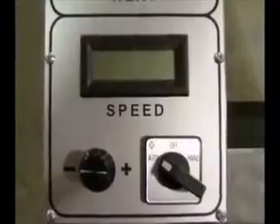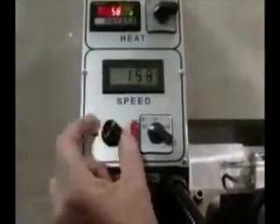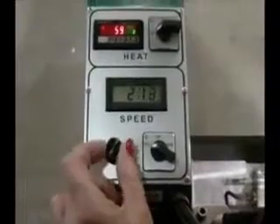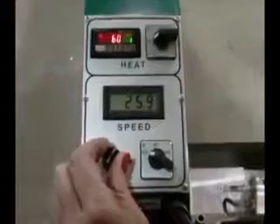Just above the power knob is your speed dial. It will give you an LED readout of the speed setting which you have chosen. If you have worked with automatic welders in the past, chances are you will run it anywhere from 11 to 15 feet per minute, maybe more, but let's not sacrifice quality welds for speed.